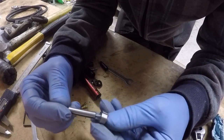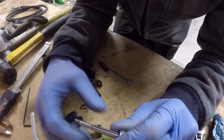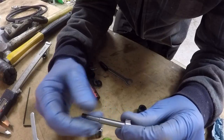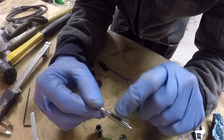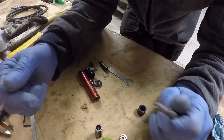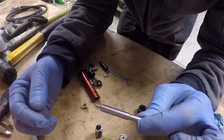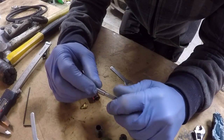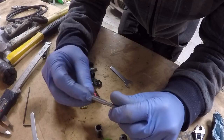So in my other air motor videos, I talked about holes in the front and rear motor assemblies, ports that actually push the vanes out into the motor walls. And you will see in this tool, it doesn't actually have those ports. So what this counts on is the fast air rushing over the rotor to get it spinning. So once I get this back together, I will show you guys. If I hold the end of the tool with my fingers and then give it air, it is very easy to stop it from turning. You need the rotor to be turning fast to have those vanes fly out against the wall and cause it to seal before you can get any torque with these.